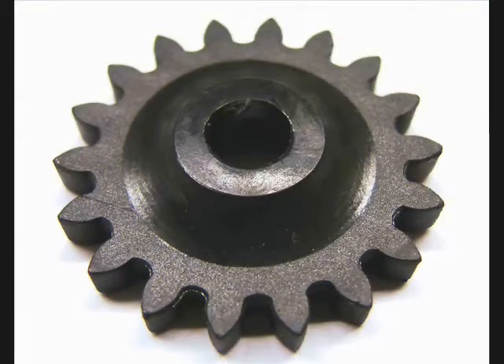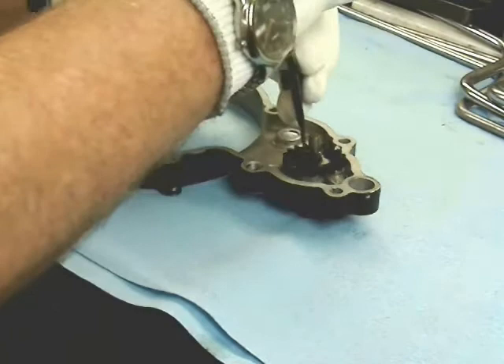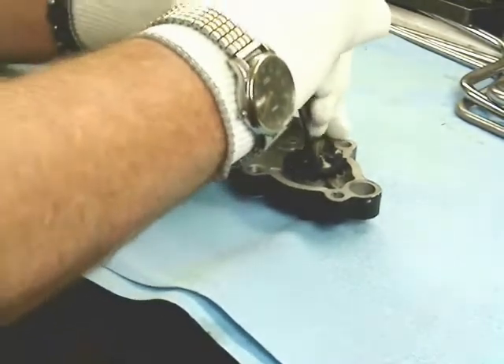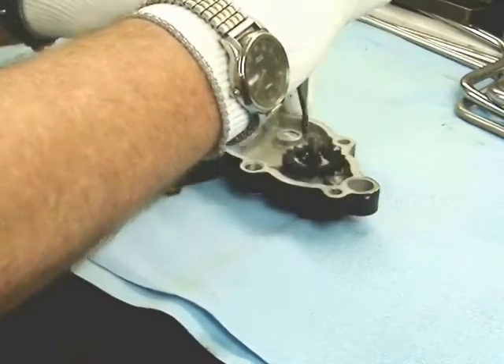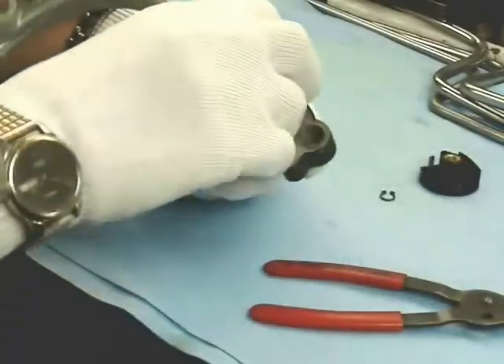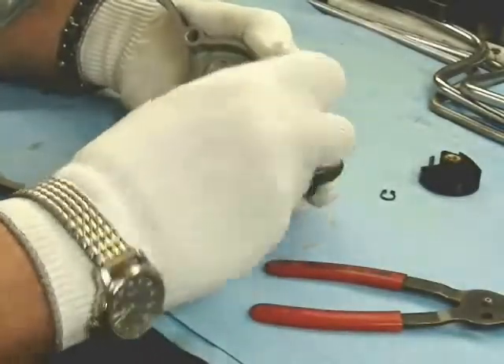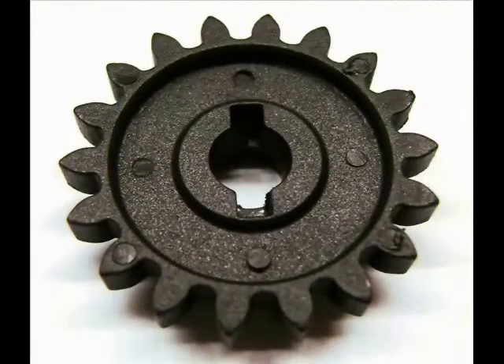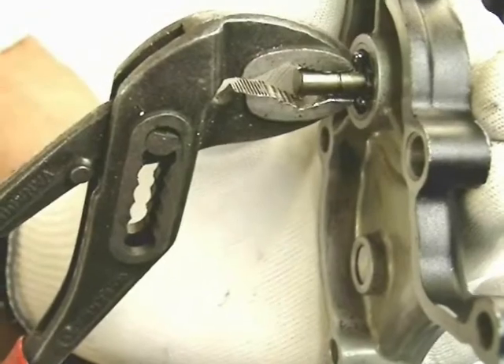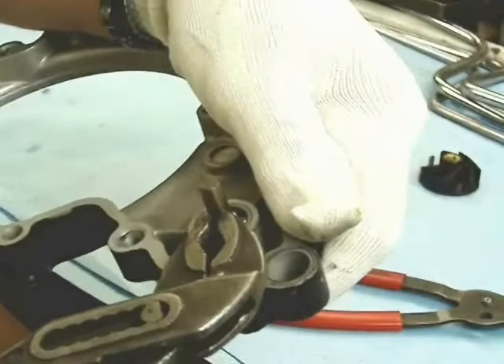This is a top view of the gear. To take that apart, using your circlip pliers, remove that little clip. Be very careful it doesn't fly off and get lost, and don't open it so much that you damage it. The back side of the gear has a slot that falls into a small pin that goes through the shaft. Here I show the easy way to get that pin out — coax it out with a small pair of pliers, grip it, and gently pull it out.